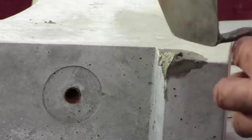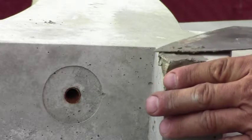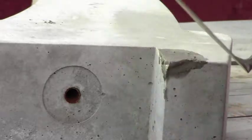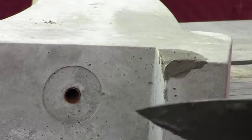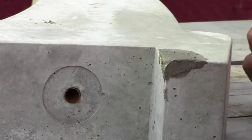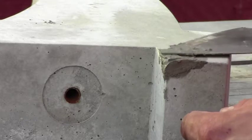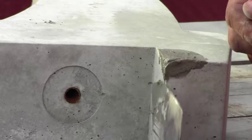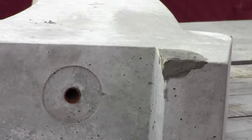Yeah, and whoop, you botched the whole deal there. Okay. Now that'll hold its form, and the final shaping we can actually do with the rub brick, so we'll square that off and whatnot. So just overbuild it just a little bit so that you've got a little bit to take down with the brick, and that ensures that you can get a nice square corner later. That's about all there is to it. Have a good evening.